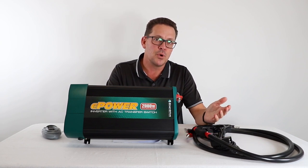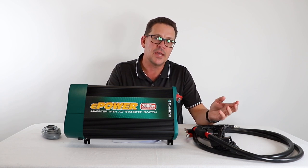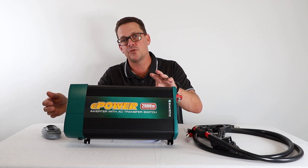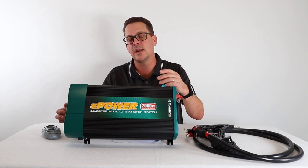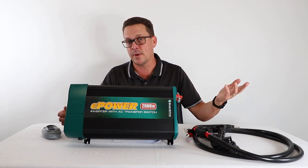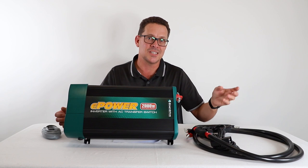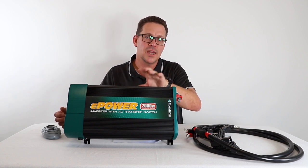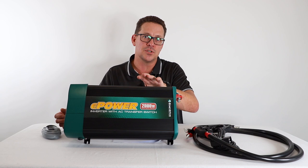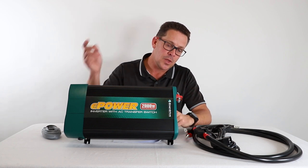The connection is straightforward — positive and negative through a fuse or circuit breaker. If you're putting your van, canopy, or boat into storage, we definitely recommend having an isolator on the supply to the inverter. Even with the inverter turned off from the control panel, it still draws a small residual current. Without AC mains or solar charging, this will deplete your batteries over time. Ensure the isolator's continuous rating is greater than or equal to the inverter's rating or your fuse rating.